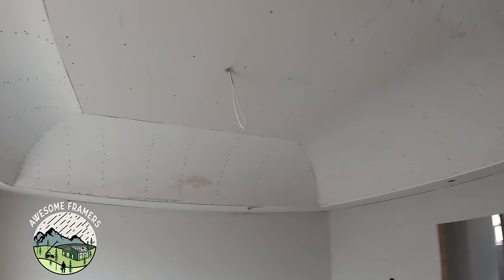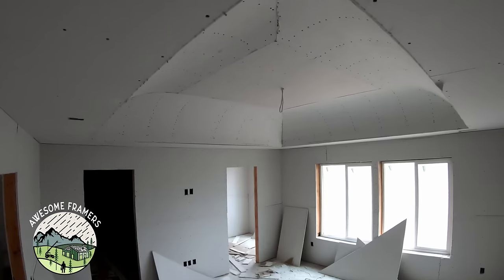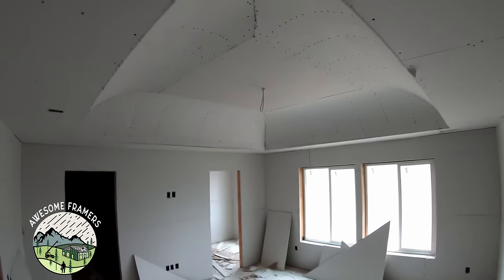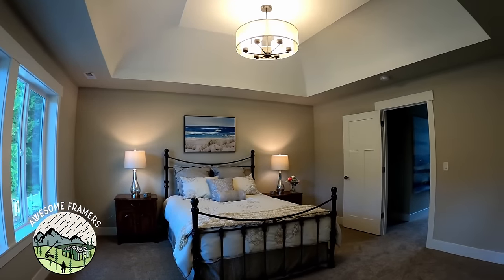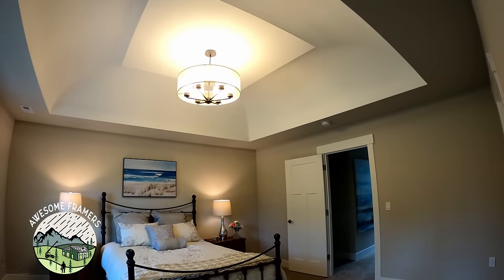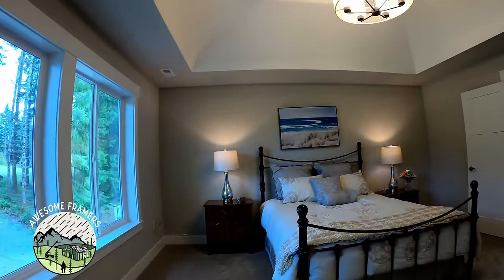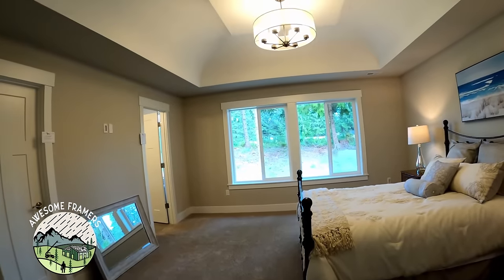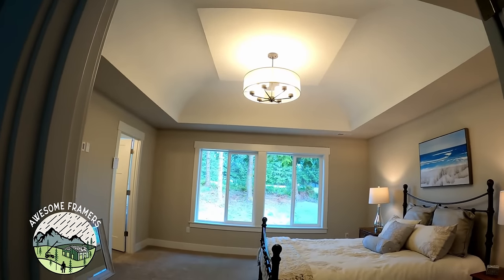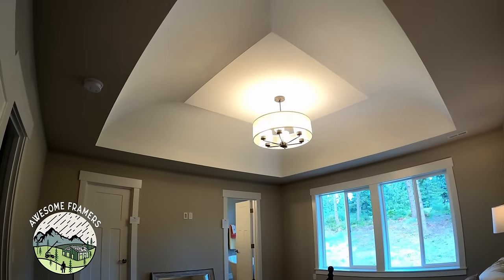We went ahead and sheeted the flat spot up there with the two bottom pieces of Advantec we had left over from the floor — that provided a ton of backing. The drywallers decided instead of double layer quarter inch, they used half inch rock and wetted one side — if you wet the side that goes against the framing it makes it easier to bend that arch, then they just put a lot of screws into it. Now it's up to the taper to do a good job making it finish out well. This is sag-resistant half inch rock, which is what they use on the lid everywhere. And here's the finished ceiling — staged, house on the market ready to sell — gives just a little bit of drama to that ceiling. Since we hand cut our roofs we always have the extra attic space; all told this took me about a day to frame, probably half a day if I wasn't recording it for YouTube. Hope you enjoyed parts 1 through 4 — please like and subscribe.